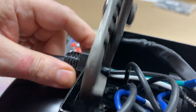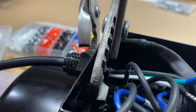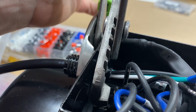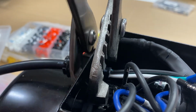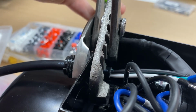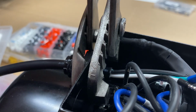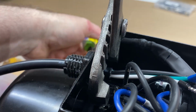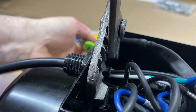Hey, future me again. If you ever find yourself in the same situation, have to enlarge in the slicer something that has threads, such as in this case 2 parts that have female threads, be very careful to make sure you enlarge it only in the X and Y axes. If you enlarge it in the Z axis, you will throw off the spacing of your threads.